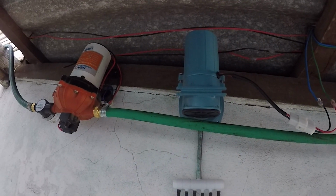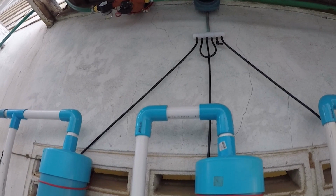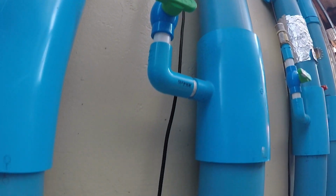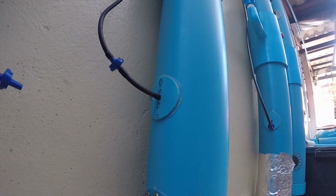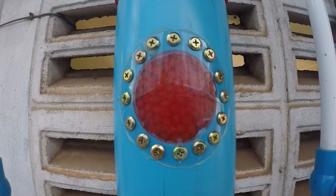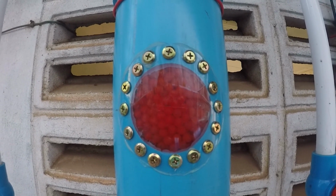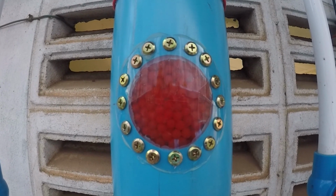The bacterial digestion process is aided by dissolved oxygen in the wastewater. We accomplish this by including a 12-volt DC air pump, pumping air into an air diffusing stone, and placing that stone and air system at the bottom of the digestion tube. Over time, the aerobic bacteria will form a film over the surface of the beads. If this biological matter is not occasionally cleared, the tubes will clog.